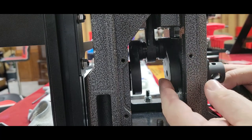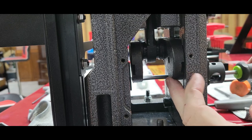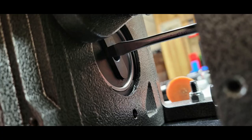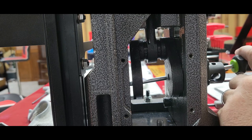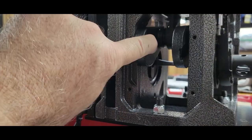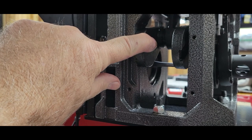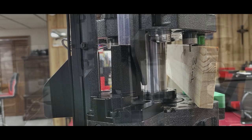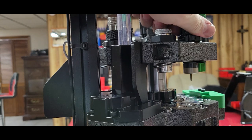Take your fingers. Pull up that cam lobe or crankshaft lobe. Put the screwdriver through the center of the shaft. And at that point, you should be able to have it on a spot on the back of your cam, and you can simply take your hammer and tap it out. If the bearing comes out with it, that's perfectly fine. Remove your screwdriver. Remove the wood block. Lower the ram.